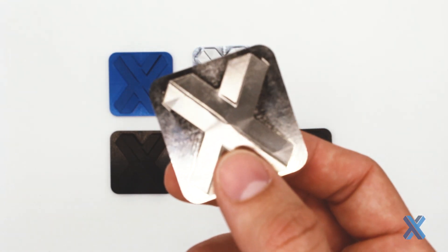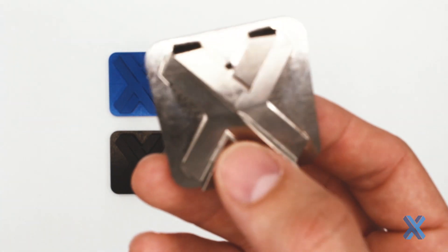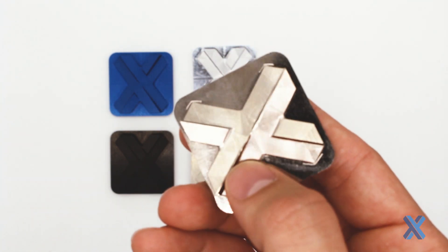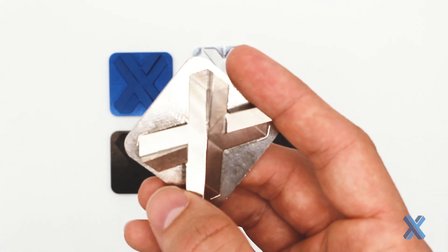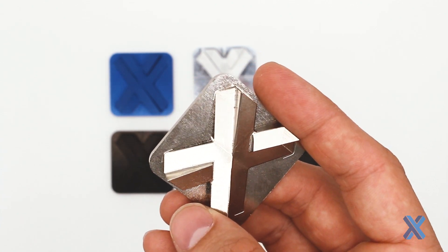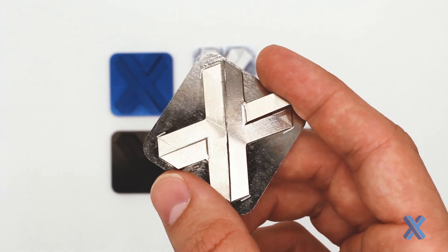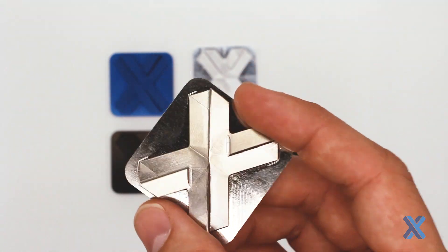Keep in mind metal plating is conductive, so it's going to have a conductive outer surface, unlike the anodized pieces. I can mill something out of copper, plate it in gold, and give it better electrical conductivity. I can take something like 4140 steel and give it high levels of corrosion resistance and wear resistance by just putting that outer skin of metal on it. By augmenting a base conductive metal and giving it the properties of whatever external metal I'm plating, I can do a lot more while often saving money versus milling directly out of that end piece.